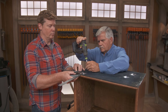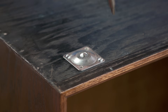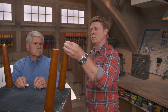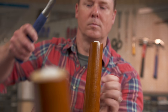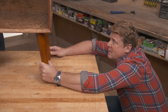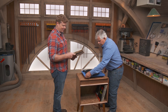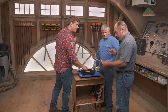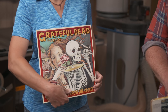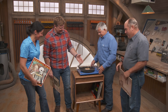Because the leg is going to sit at an angle, we want to keep the bracket about two inches from the side and one inch from the front so it's not going to tip forward. These are tapered round legs — pretty common with the mid-century modern design. I got 12-inch legs because I want the cabinet to be at a certain height, and the 12 inches will work. I'll flip it over and we can adjust the leg. Tommy, your choice — GI Blues or Blue Hawaii? Blue Hawaii! Wow, old school. No more Elvis, Tommy — how about Crosby, Stills, and Nash? That's too hippie. We've got a little Grateful Dead. Are you a deadhead? I just went to 35 shows and Jerry's funeral, but I'm not a deadhead. This is the best right here. Tommy, a very nice build — well done. Thanks for the help.